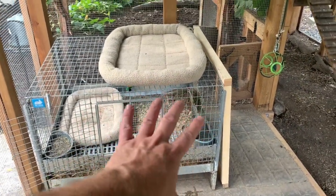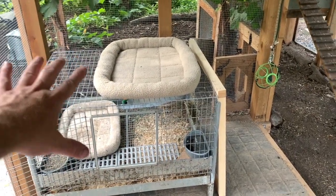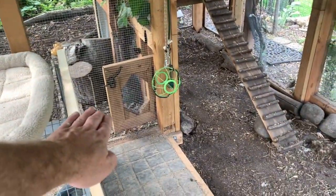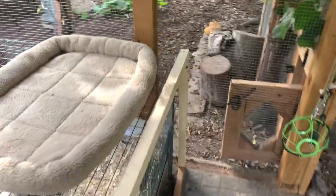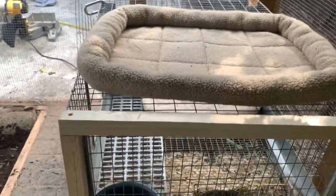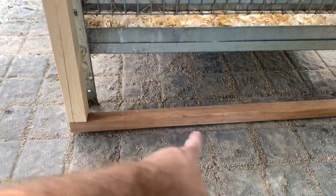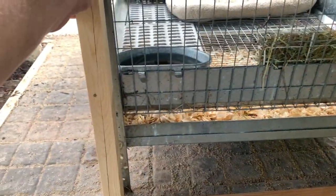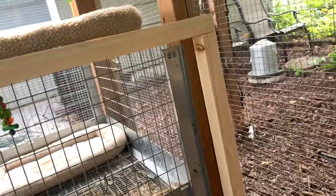Here's the basics of it. The bunny hutch is going to sit back in this corner, with the bunny house — kind of like a doghouse — going here. I'm going to start making stick frames out of two-by-twos, green-treated lumber on the bottom, so it's going to be flush from the top, sticking out a little bit in the back for the back piece to go across.